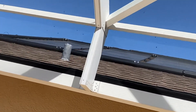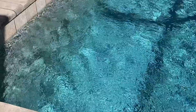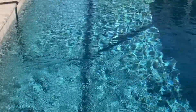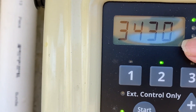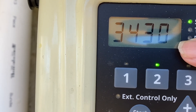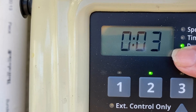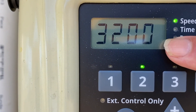Here are the solar pool heater panels up on the rooftop — I have a separate video explaining those. Let's see how the pool settles down. I just stick my hand in here to make sure it's good flow — that's actually really good flow. You can always adjust speed up and down and repeat the procedure. This customer's pool is about average, roughly 15 by 30 or so. And see — it went down to 3200, right now we're at number two speed for solar.